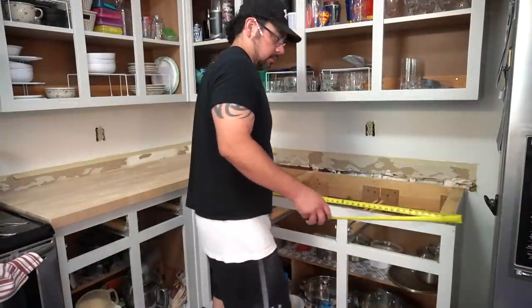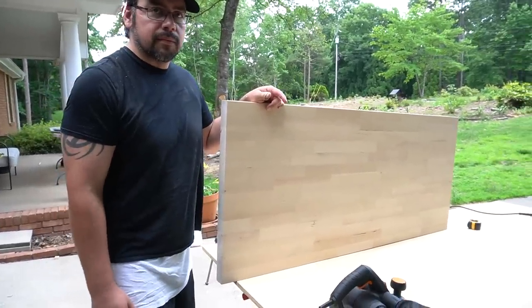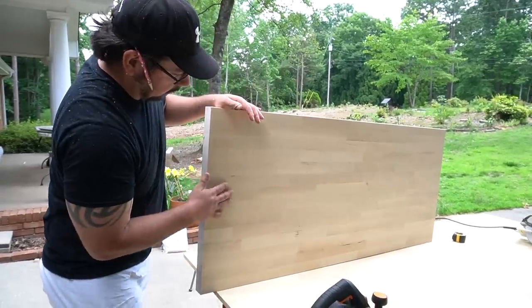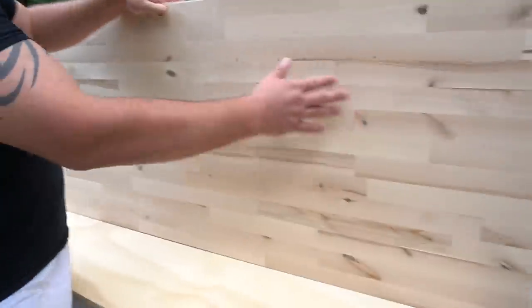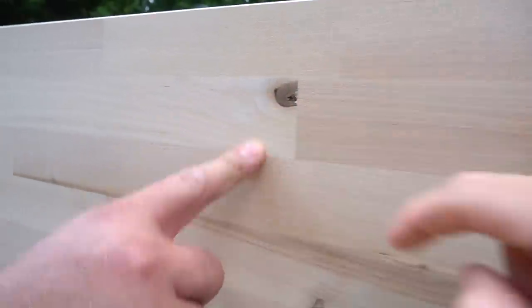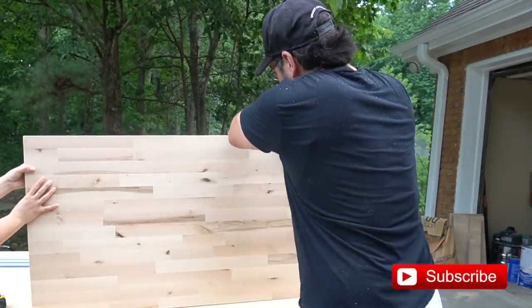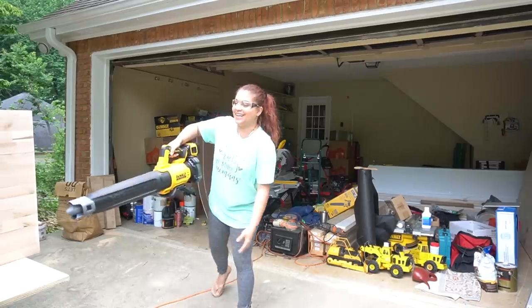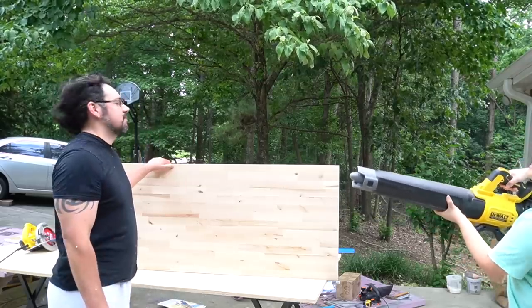After the first one went in we would measure for the next one. If you're wondering which side is supposed to be the top side for your countertops, it's really easy to tell. Ours came with additional padding on the top side, but even without that you'll notice that the top part of the countertop is very smooth with no knots or imperfections. On the other side you'll start seeing a lot more knots and little crevices. That's how you can differentiate which side is top and which is the bottom. Keep in mind we only needed to plane the sides that were going to be touching each other and joined together, not the rest. And we also tried to have some fun along the way — if you guys don't have a blower, it's definitely a favorite tool for the outdoors. It's a great way to clean up your Latino engineer.